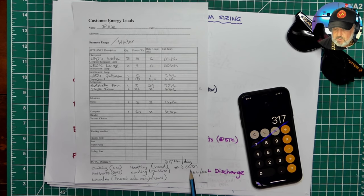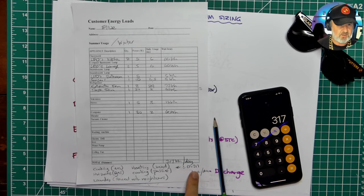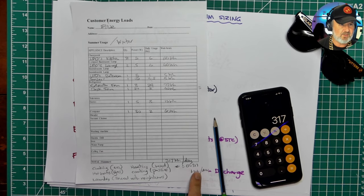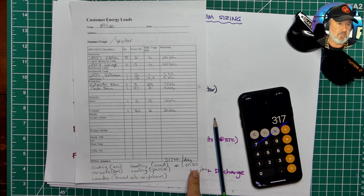So one thing we omitted in this whole thing, I just realized, was the fridge. There is actually a refrigerator in her place, and it's a small one, but small doesn't always mean efficient. So unfortunately, quite a lot of the very small fridges are quite inefficient. They're designed really to be compact and therefore have minimal insulation, but there are good small fridges. So at least I'm pretty sure it's got a pretty good one. But it would probably use up to twice as much as everything else. So I'm guessing from measuring her house, I think she was around a kilowatt hour per day.